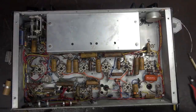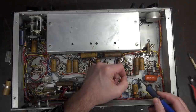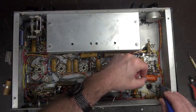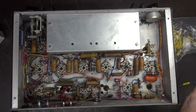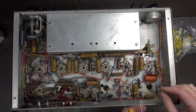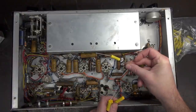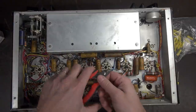This one's not too bad to work on — it's pretty wide open. Some of these radios, you look up in these cavities and you see these wax caps and you're like, oh man, there's just no way. I've done a lot of replacements using tweezers — brain surgery. So my plan of attack is I'll start by changing out all the 0.1 microfarad caps. I'm going to replace them with these Mallory 150 series caps — they're nice, they're small, and they're rated at 630 volts.